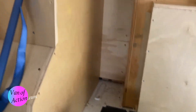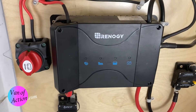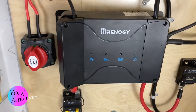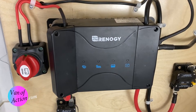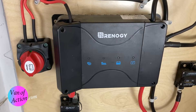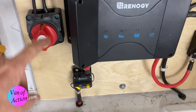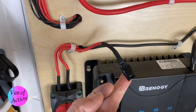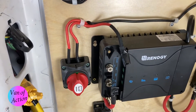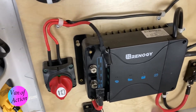Here are the two batteries that will be going up into the battery compartment. But before I do that, I want to check my charge controller. Charge controllers are one of the most critical parts of this system and have to be handled properly. You cannot have any energy going into a charge controller until that energy has a place to go when the charge controller is finished with it. It can't dead-end at the charge controller or you will burn it out. So last fall, even though I have a disconnect and a breaker, I also disconnected the wires from the terminals. This is the hot wire coming off the roof solar panels. It's important to note that solar panels don't have an on-off switch — if they're exposed to any light at all, they will generate some electricity. So you've got to be sure, before you connect this to the charge controller, that the battery is connected at the other end.